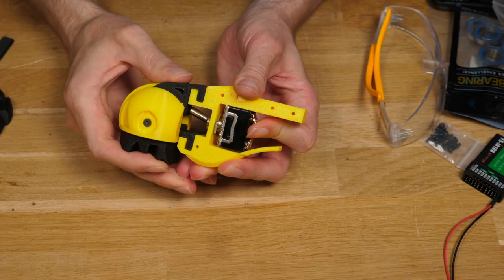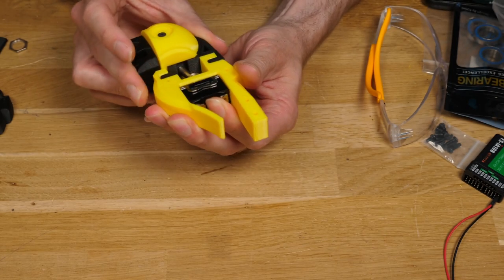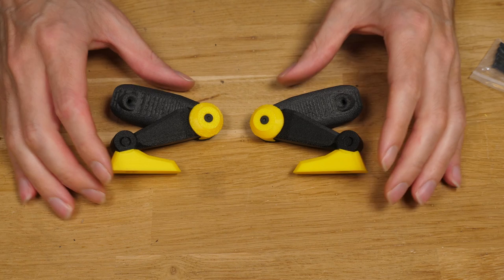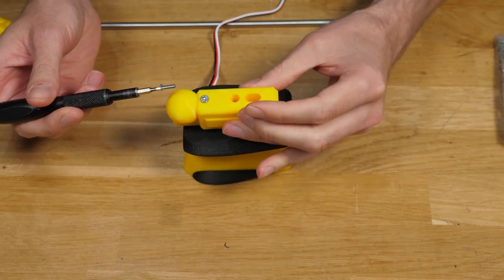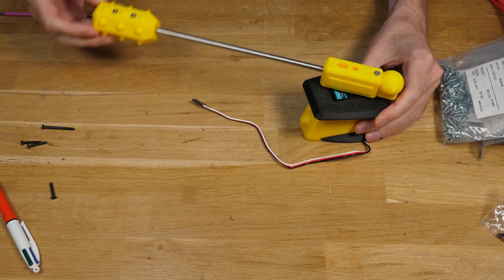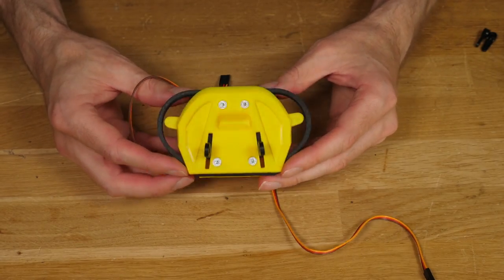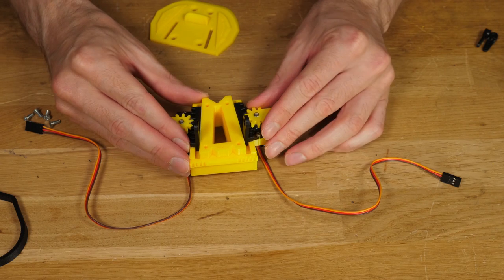Next, I assembled the rider. The most important part here is the kill switch — it needs to be at the right height to trigger with the head movement, and the right orientation to be on or off at the right time. The body pieces can be a bit confusing to see how they fit together initially, but referencing the part names helps a little bit. Moving on to the rear post and bludger arm, I found that the default design required holes drilled through the steel shaft, which wouldn't be very easy for most people, so I modified the design to use screws that grip into the arm instead. It's easier to assemble, and also to remove the arm later if needed.